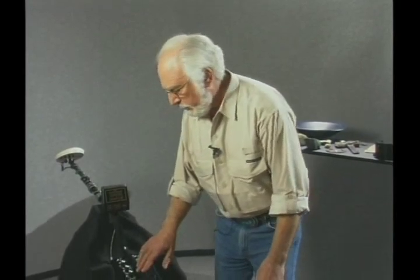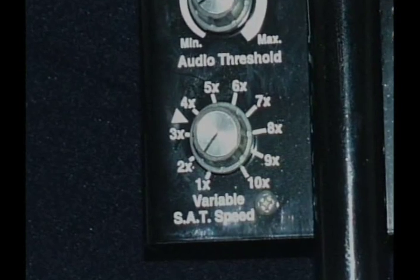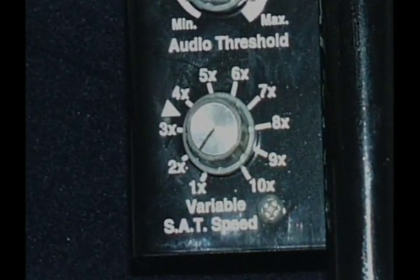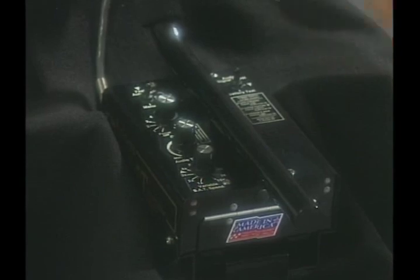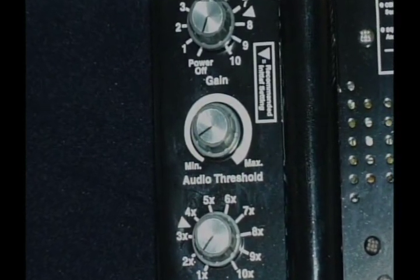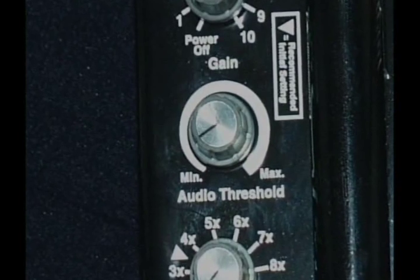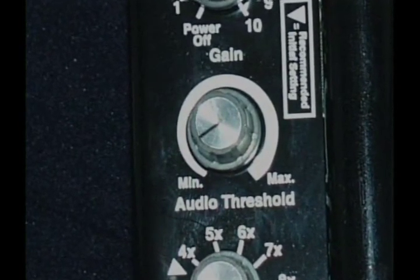The first control is the variable SAT control, as found on the last three Gold Masters. It has a preset position on the dial, somewhere between three and four. These numbers are reference points; the preset gives you what Jimmy calls the normal speed of self-adjusting threshold. The threshold is controlled by the knob forward of that. It has no marks on it and is the only one you'll really have to set on your own — turn it clockwise to get an audio threshold that's comfortable to your ear. With headphones you'll set a much lower threshold; without headphones the threshold will be a little louder so you can hear the faint hum typical of GEB detectors, of which the Gold Master is one.